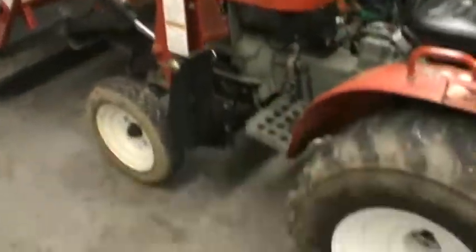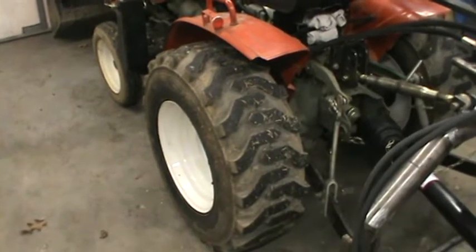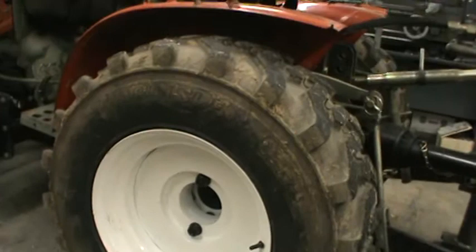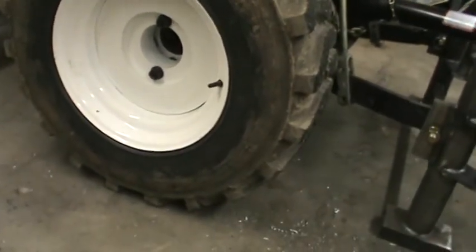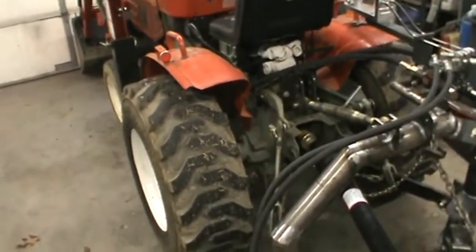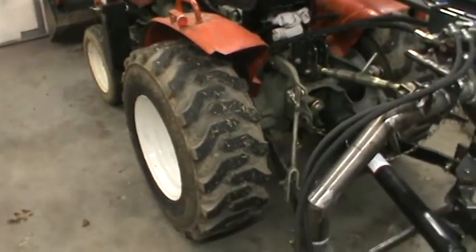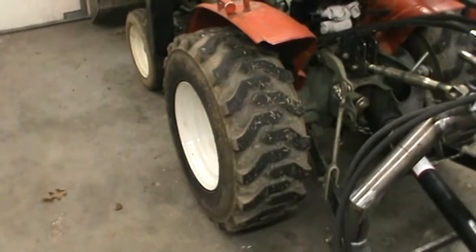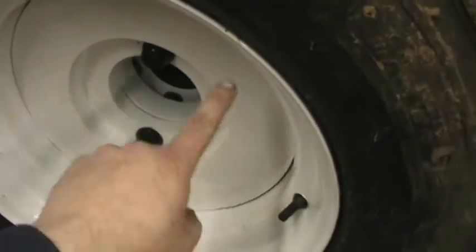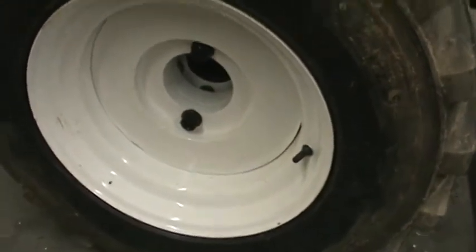Back to the tractor — the wheels. If anybody owns a little Yanmar, they usually have rice paddy tires on them. There's a big thing on TractorByNet and stuff that you can find about wheels for your Yanmar. I'm real pleased with these R4 tires — got rid of the rice paddy tires. As long as it's not really muddy these are a whole lot better. It doesn't tear your turf up and it's a lot more stable on hills. For that conversion from your Yanmar, I've got probably $800 in the tires having Haywheel Machine Company make the wheels for me. I painted them and put a counterweight in them that came off a machine where I worked — all I did was bore two holes and it slid right in. It weighs 98 pounds, cast iron. I've got liquid filled in the tire — each tire is probably close to 350 pounds. This little tractor gets all kinds of traction.